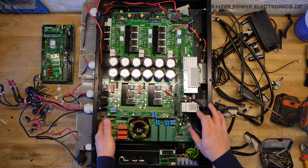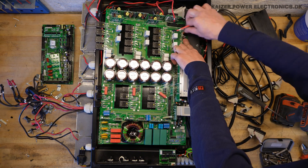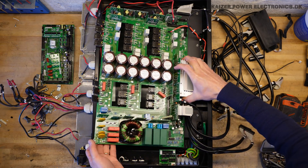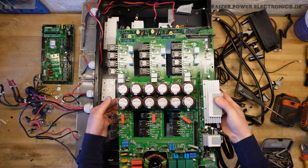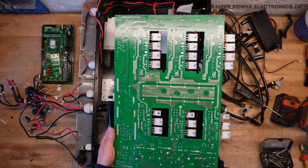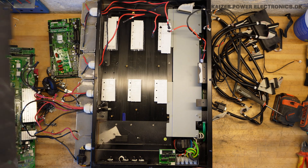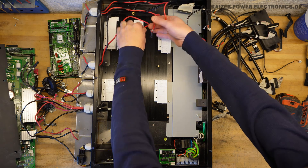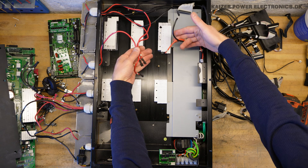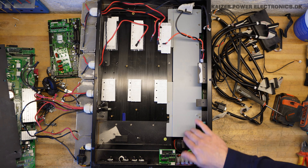It seems like it's completely free. So many screws in the middle of the board — that's really sturdily made. Just have the last few cables in the back here, let's get those out. But look at that PCB design — that is freaking huge. And a lot of reinforced PCB tracks on the back side. What a board. Clearly something is hiding underneath this piece of plastic, and we also have some kind of metal plate here. The output legs — we have three red wires going out to the output chokes, along with two for maybe a DC link. That goes underneath the metal plate out to the 3-phase mains connector.